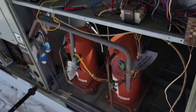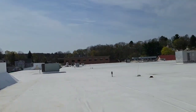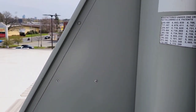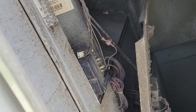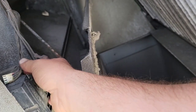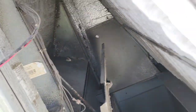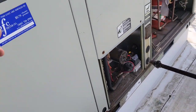Right now the unit is off. This is a forgotten part — it depends on your weather. Today it's about 75 degrees, so it's too warm. In here there's something called an economizer. That economizer will lock it out when it's too warm or too cold. You see this button right there? That's the power — you pull that out of the economizer, because right now it's sending a signal saying don't turn on heat.